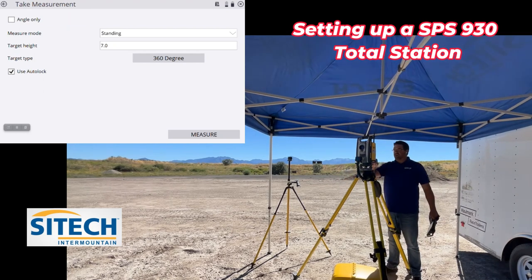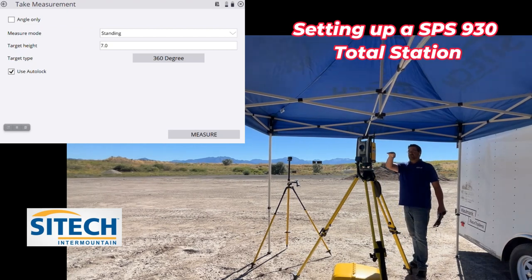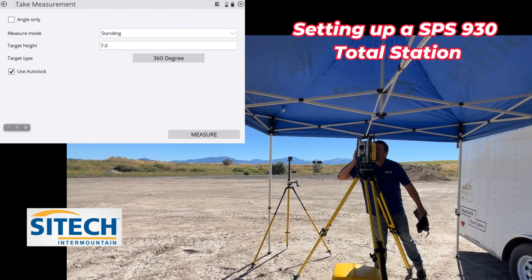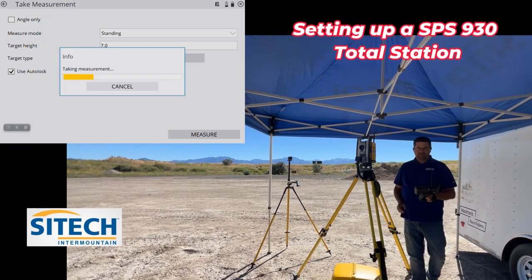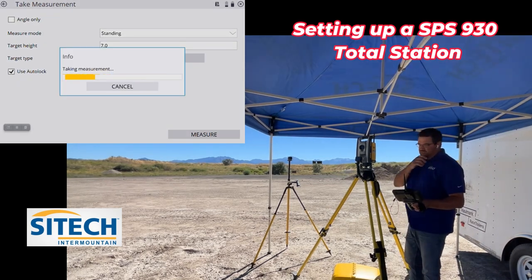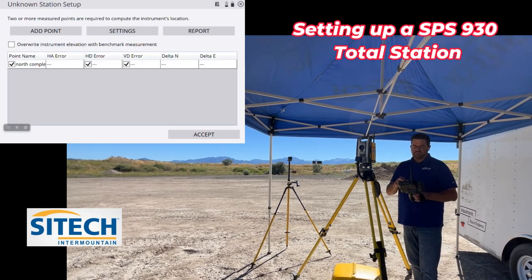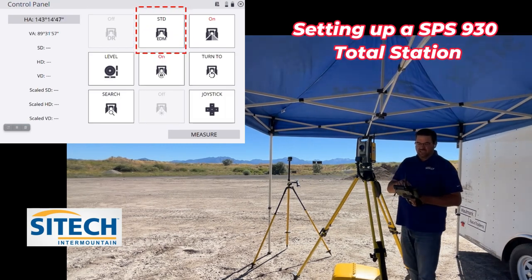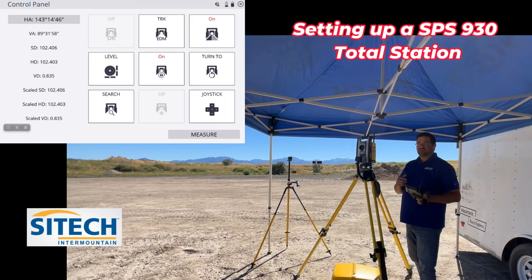It's asking the target type. In target type, I'm going to go in there and find that prism. If you don't know what it is, click through and it shows a picture on the left side right here. That one over there is actually a 360 — it's a Trimble. If I hit 360 degree, you can see that it shows the exact same one. I'm going to hit OK. Then gently grab the total station and aim it to the one you need to, and it'll actually catch right on to it. You've got the little sighting glasses on the top or the bottom, and as soon as you look through those and get it close, you'll see the total station just walk on to it. You can look through the back to verify, and if you need to change the focus, it's the top button. As soon as we're there, I'm going to hit measure. If it's on standard, STD, it may take just a little bit longer. You can change that in the top settings to tracking, which will make it shoot a little bit faster.